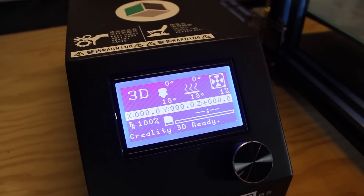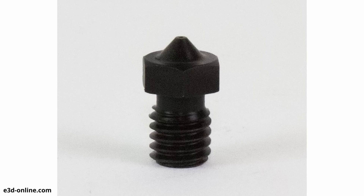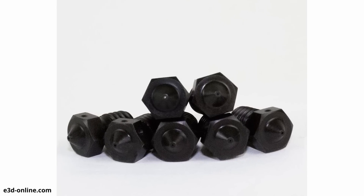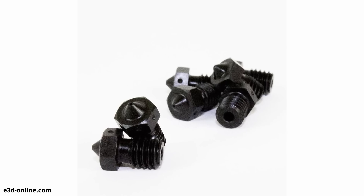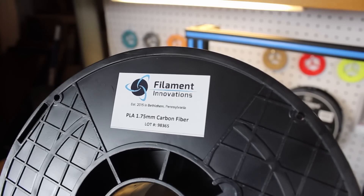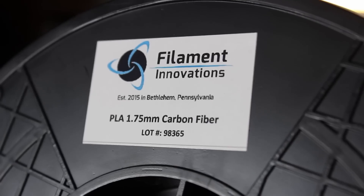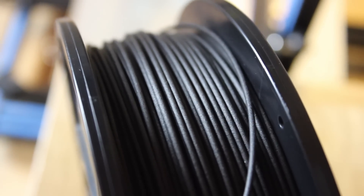Starting with Tier 1 — there are usually parts from the 3D printer that wear out over time and can easily be upgraded, and there are many upgrades you want to do right when you take the printer out of the box. The first upgrade is a hardened steel nozzle from E3D. This upgrade is not necessary to print, but the brass nozzles that come with most printers will wear out over time and not produce the best print quality. The hardened steel nozzle is much tougher, lasts a lot longer, and protects against abrasive materials. If you're interested in printing exotics like carbon fiber, wood, or metal filaments, you'll definitely want this. I chose the E3D nozzle because they are a trusted company — and even though $20 for one nozzle is a little high, it is totally worth it.